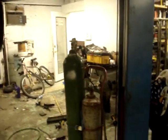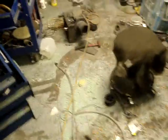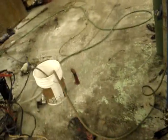I did a lot of tests. I have a compressed O2, oxygen for oxyacetylene set up. Alright, now to make this meter change 0.2 volts, it takes over 6 liters a minute. So there's a huge amount of gas, and this is straight O2. So even if you're introducing 2 liters a minute, you're only introducing 33% of that 2 liters per minute as oxygen. But it is monatomic. It is only O.